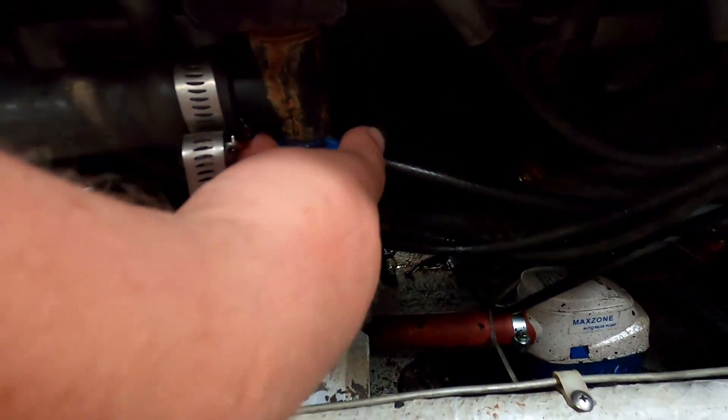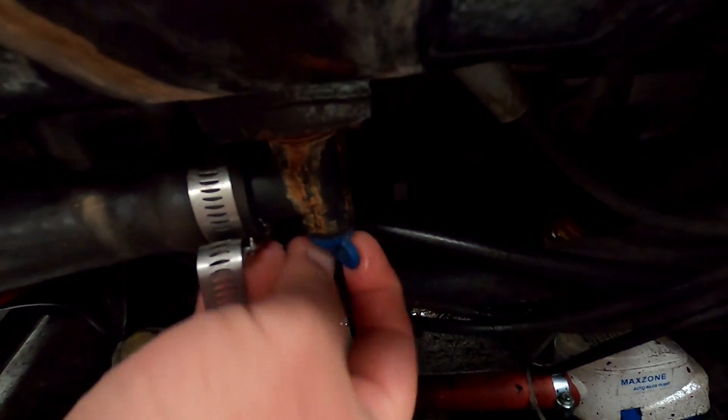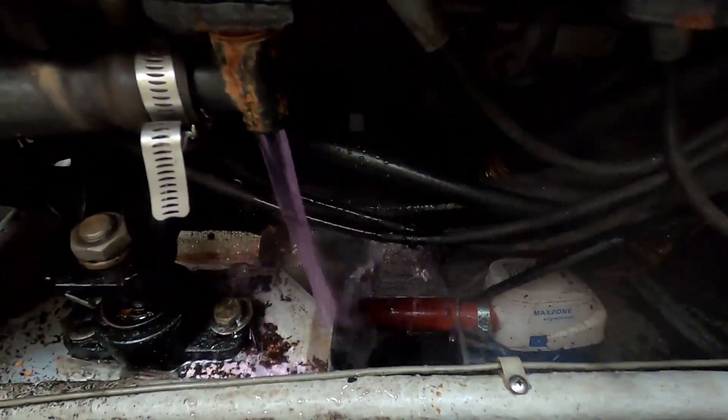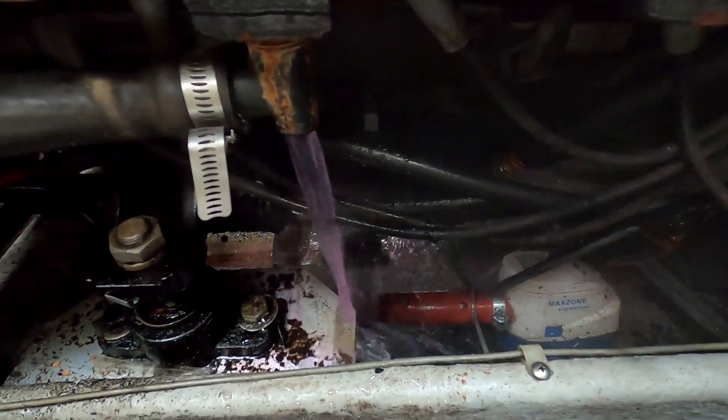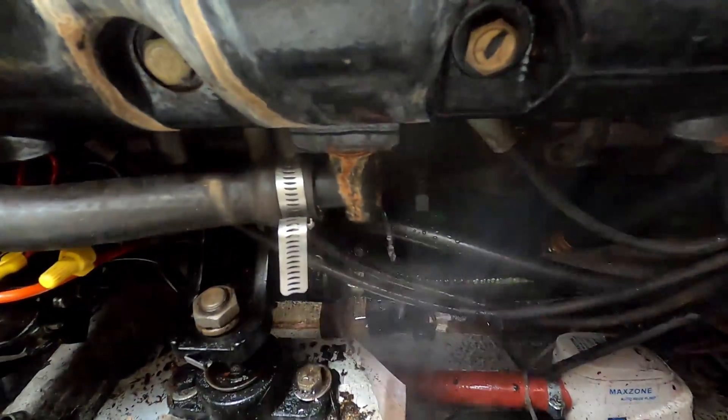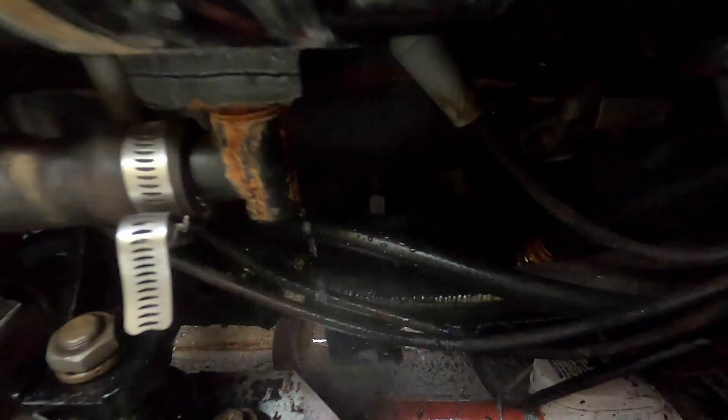So right underneath this exhaust manifold, there's this blue wing nut. I'm going to turn this and hopefully not get burned because that water coming out is warm. It's hot — oh god, hot. Nice and pink, see all the steam coming up. I can smell it. It just drains out this manifold here. All right, so now that that's done, if you go down below here, there's another butterfly valve way down here and I'm going to crack that.